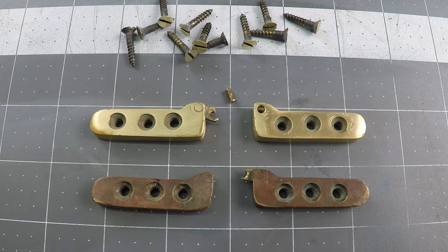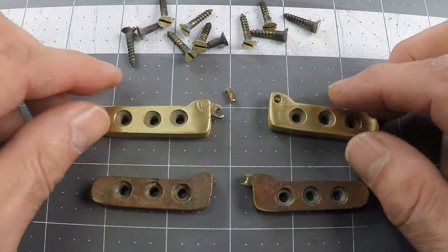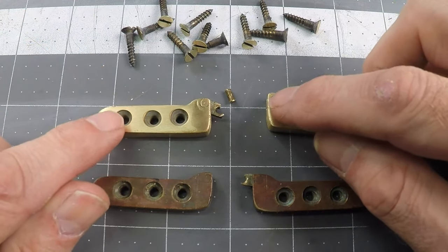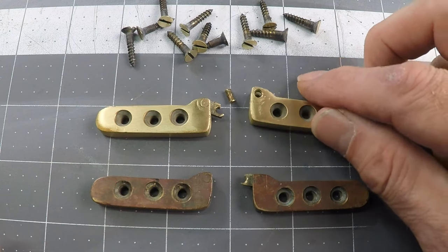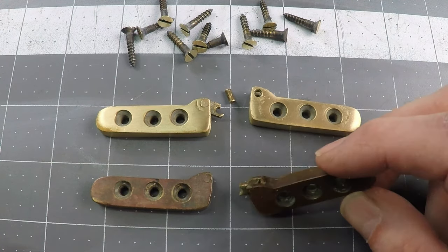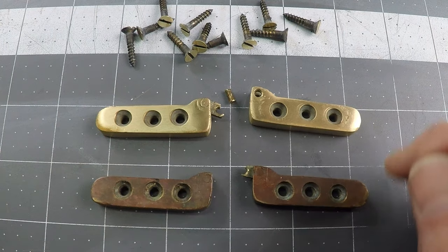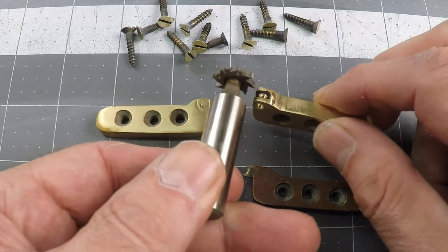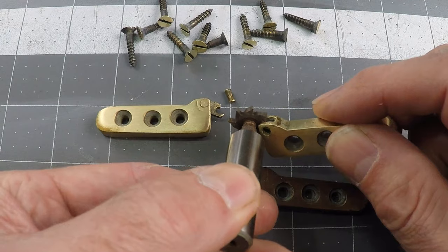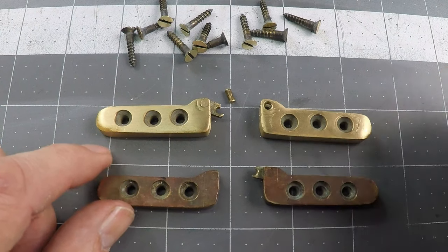So these are the pictures she sent me. I got the hinges and polished up one of the sets of hinges with the Scotch-Brite wheel so I can see what's going on. As you can see there's a broken link in both cases, and that's a pin that I drilled out of this hole on this one. The holes are opened out a little bit so the pins can mushroom out when they're pounded in at both sides, which causes a better fit and prevents them from coming out. Notice that the holes are all uneven — this is clearly handmade with a file and a hacksaw, very primitive fabrication. I'm also curious to know how that slot was made. This is a woodruff key cutting tool, and they wouldn't have had that back in the day, so I really don't know how they hollowed out that little section for the hinge. It's really interesting to me.